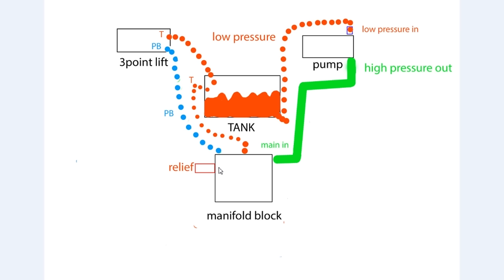I really do not think adjusting the relief valve is a good idea. As it is right now, the hydraulic fluid enters into the manifold block and goes past the relief valve. If the relief valve senses that the hydraulic fluid is too high pressure, it will open up and dump all the hydraulic fluid back to tank. This red dotted line is the back-to-tank port located at the back of the manifold block - it sends the hydraulic fluid up this line and dumps it directly back into the tank where it can cool down and be reused.